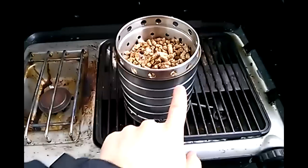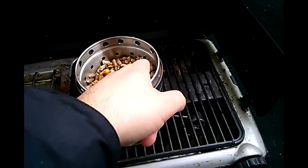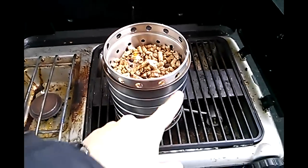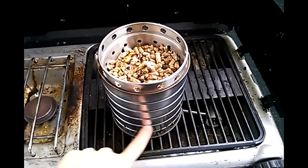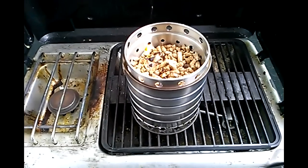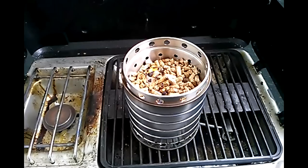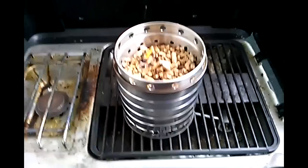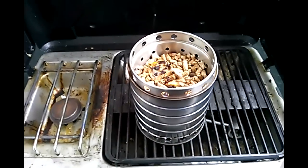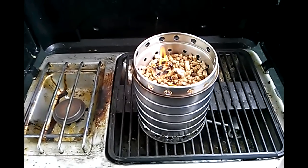The main things I've changed were these air holes here — made them quite a bit larger. For the secondary air holes, I just had one row of them in this one. In the first one I had another set down lower, but I don't think that helped too much — I think it let in too much wood gas. The major change is that the primary air holes at the bottom are quite a bit smaller, so we're looking for a much leaner mixture of wood gas to air.